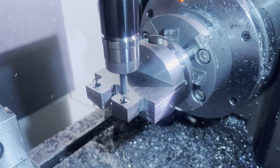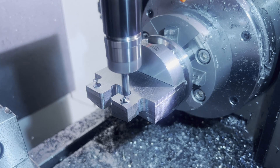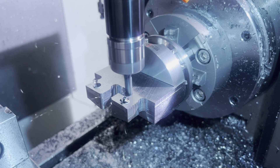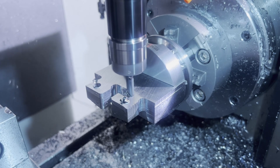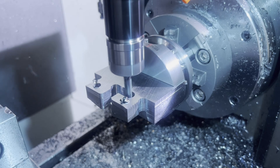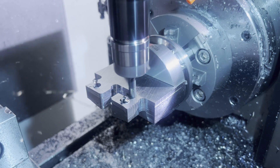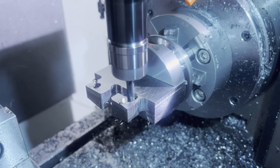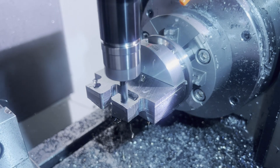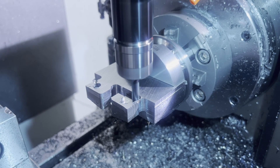Since a lot of my stock is either one inch or three-quarter inch material, I use these slotted holders a lot — a very cheap, effective way of holding onto them. They're a little bit smaller than a vise so you give up a little bit of material to hang onto it, but I'll stick a pretty large slab of material in these and just whittle parts off of it. Really cheap work holding and very secure.